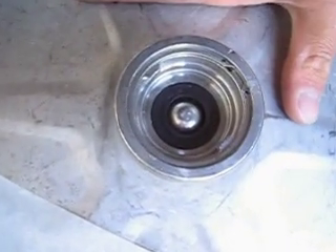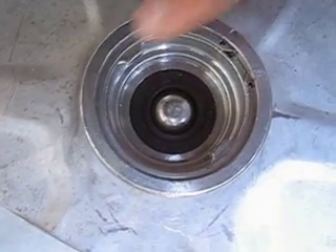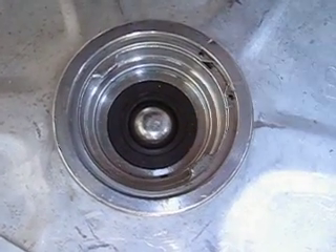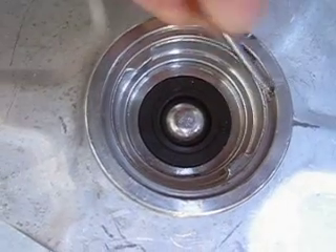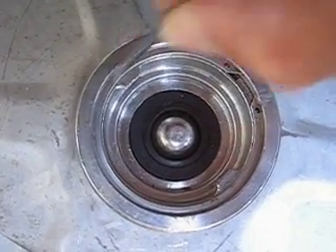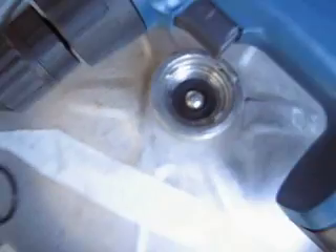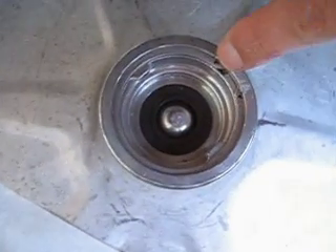So CUB and Tui's and what not will use this type of keg. The only problem is we can't get it open, because obviously you need to get it open to get your home brew in there. So we need to first take out this little ring around here — it's like a washer which we have to take out, it's made of stainless steel. What we're going to need is a screwdriver — this is just a cheap one from Bunnings — and also a tungsten tip drill bit.